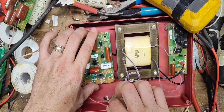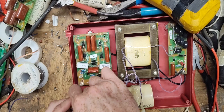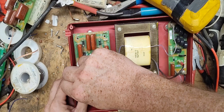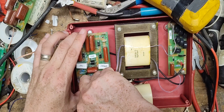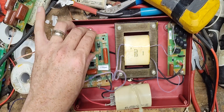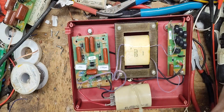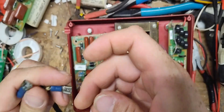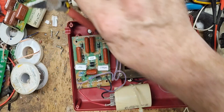Let's get this board put in temporarily. Everything's labeled where it goes, which is nice. Once I get the resistors here, we'll fix this original board up, put a new capacitor on there, and check the SCR as well. Let's also plug in the power cord - I'm going to change out these connectors too; they're not in very good shape. They're very loose, so we're going to cut these off and redo it.